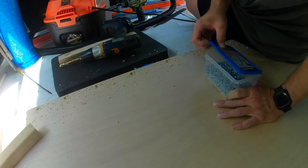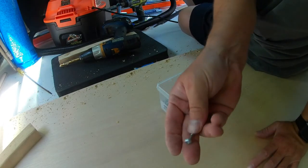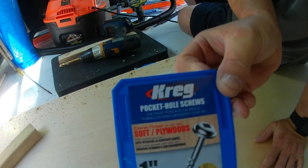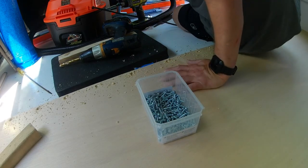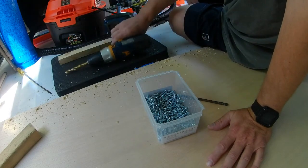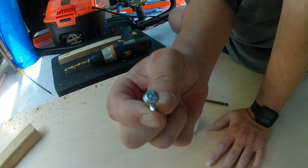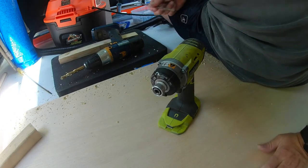This is what we've been doing pretty much all around the edges. I'm just using 1-inch Kreg Jig screws. If you've never seen the packaging of a Kreg screw, there it is. I'll put the link down in the description also. But again, I'm just taking a 1/2-inch bit, which leaves enough for the head to go down into the wood and grab it and hold it. See how that head is flat on the top?